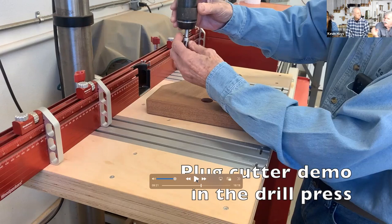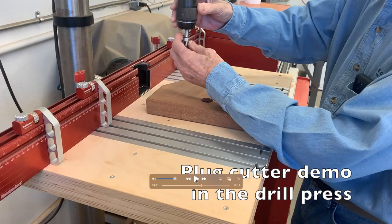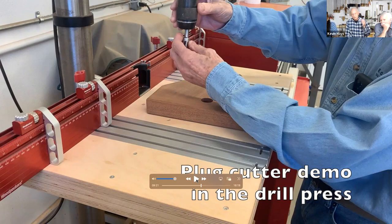So we want to limit that twisting force with the machine instead of having to do it mechanically by our own feel. So the torque setting is the key to fine woodworking. In this example you saw before, with the little number two screw, these machines are so powerful that they will shear any screw if you torque it too much or spin it too much. So you should start on the light side and build up? I would say the smaller the screw, the smaller the torque setting.